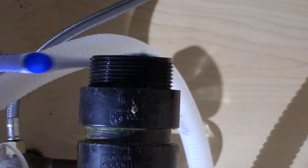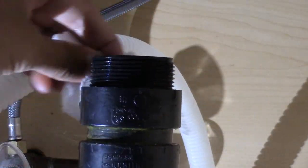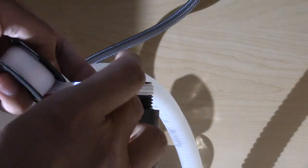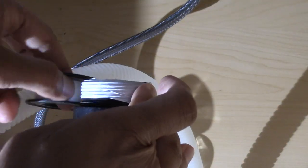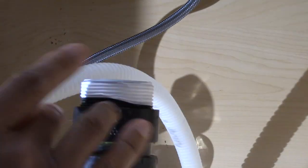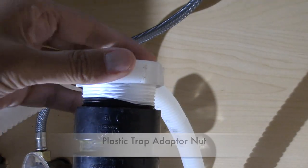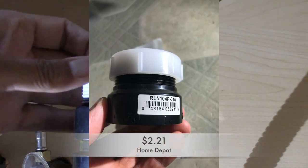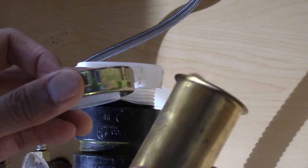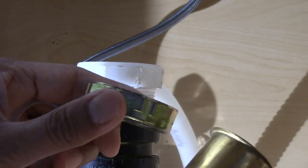The first thing I do is quickly brush and clean the ABS threaded adapter, and also clean the surface area under the hole. This is optional, but I always Teflon tape this threaded area. I cleaned up my old trap adapter nut so I can reuse it, though I did buy a whole new nut and trap adapter assembly for the other side. Notice inside this copper nut is a fitted plastic white seal — this is how we install the extension into it.